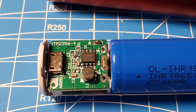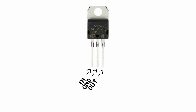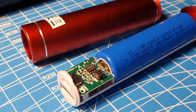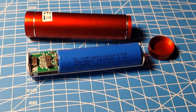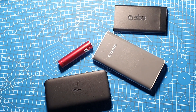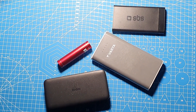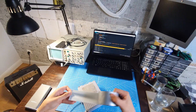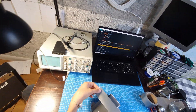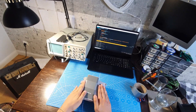For power, I was planning to use solar panels and a voltage stabilizer to keep the voltage at 5 volts to charge a power bank that could be both charged and discharged at the same time — this is called pass-through charging. Unfortunately I couldn't find a small power bank that would fit in the case and support that feature. So I modified the project requirements a little and just slapped a big power bank on top. This should keep the system working for long hours.